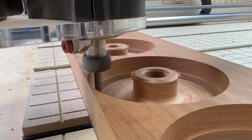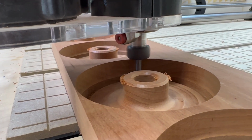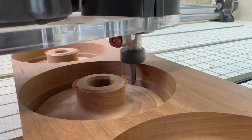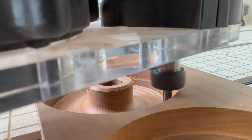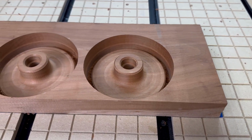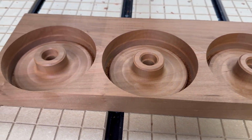One word of caution, if you decide to add a chamfered edge to the bottom section of this smoketop, is the clearance between the bottom of the collet and the stock is really tight. So make sure to set your bit shallow in the collet to give yourself the most depth, and double check your measurements before you do any carving, because that can go sideways really quickly.